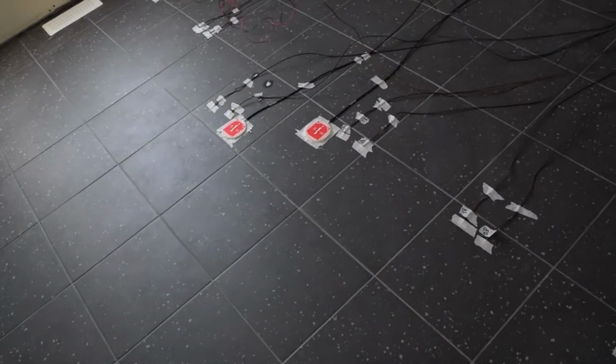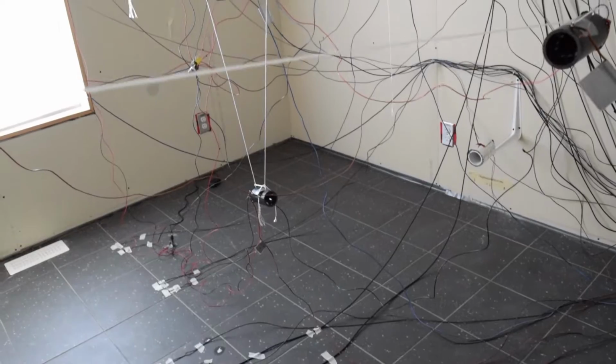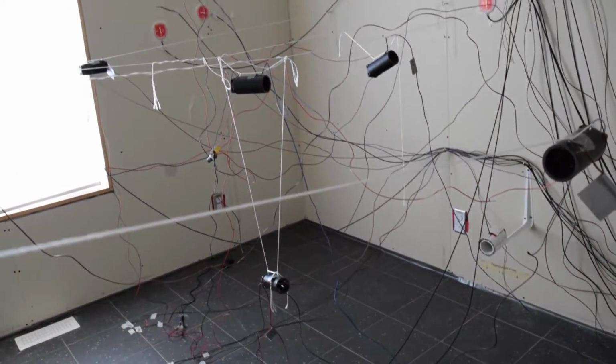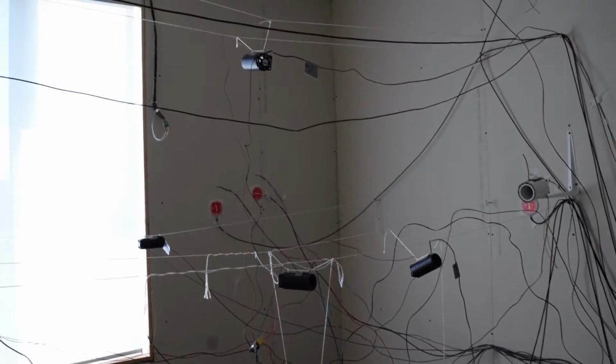We've got these red discs on the floor that measure the heat flow rates off the floor surface, and thermocouples that measure temperatures at floor surfaces. So he's been able to run experiments in this building to use to validate this mathematical model that he created.